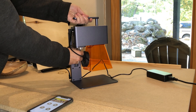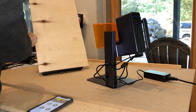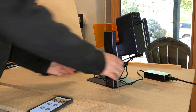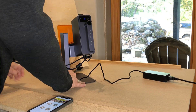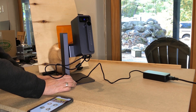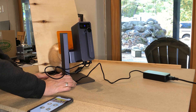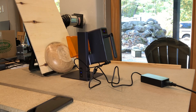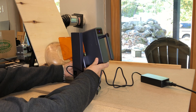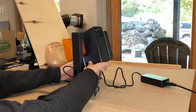I want to show you one of the other cool things about this unit, and that is the base is adjustable. The base goes up and down, but you can also rotate or tilt the laser unit. The maximum size you can do on the LaserPecker 2 is 100 millimeters by 100 millimeters. In this instance, the diameter of my bowl is larger than will fit underneath the laser unit if it's attached to the base, but because I can tilt it, I can set it at the appropriate angle and engrave it on more of a horizontal plane. So you're limited on the size of the image you can create, but not on the size of the workpiece, because you can tilt it or just remove the unit from the base.